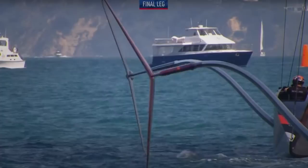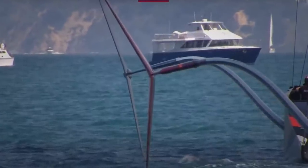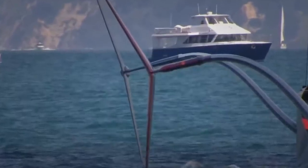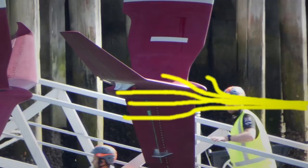All of these things are a trade-off — if you gain in one area you're going to lose in another, and decisions will come down largely to what conditions they're optimising their boats for: upwind, downwind, expected cant angles. On the T-foil the junction intersection angle is tighter. You effectively have two aerofoil profiles that, if matched up, get much thicker at the same place. The flow accelerates around the low pressure face of the foil, and at the speeds these boats are going you can get into the realms of cavitation.